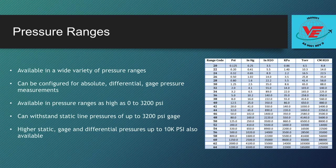The P66 can be ordered with full scale digital readings for differential and gauge pressures as low as zero to plus or minus 0.1 psi differential. There are in fact six different full scale ranges between 0.1 psid and 1.0 psid. With an accuracy of 0.25% full scale, and optionally 0.1% full scale, the P66 is ideal for measurement of very low pressures. It is also available in pressure ranges as high as 0 to 3,200 psi, covering typical automotive hydraulic and brake pressures. Altogether there are 23 different full scale pressure ranges from 0.1 psi differential up to 3,200 psi differential.